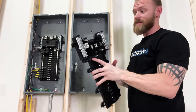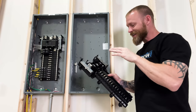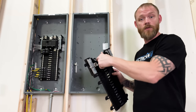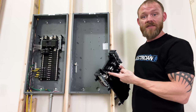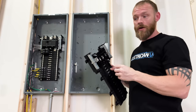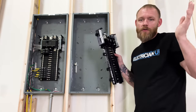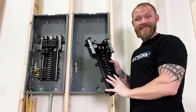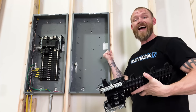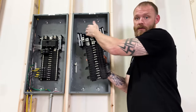A lot of you might not realize that these things come out. Sometimes if you damage one — and I actually did one time when I had just gotten my residential wireman's license — what I did is I left one of the conductors not all the way tight. So there was a little bit of an air gap, and what it did is create a hot spot because there was all this arcing and a very high impedance point where current was heating up the insulation on the conductors. It actually heated up this entire lug so it was glowing red hot. We all do dumb stuff when we're apprentices, right? So we actually had to replace the entire panel board inside of that enclosure. You can actually get just a panel board — if something's messed up with a panel board, you don't have to get the entire panel. You can order these from the supply house.